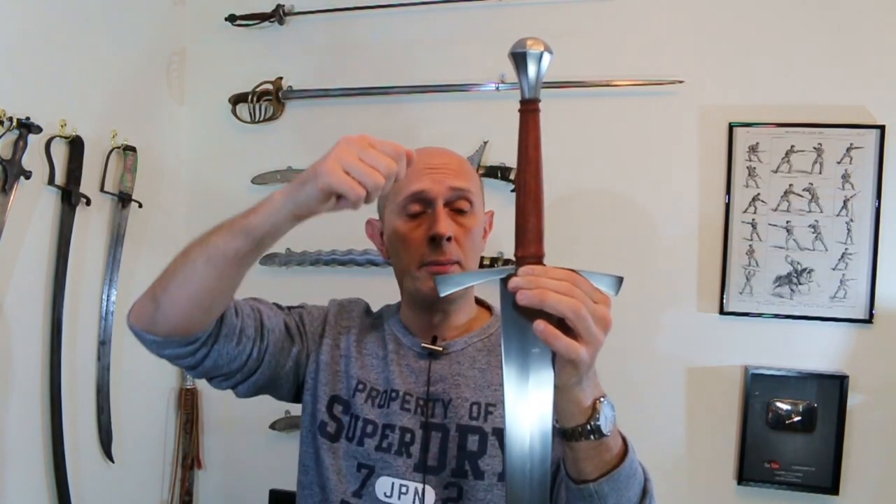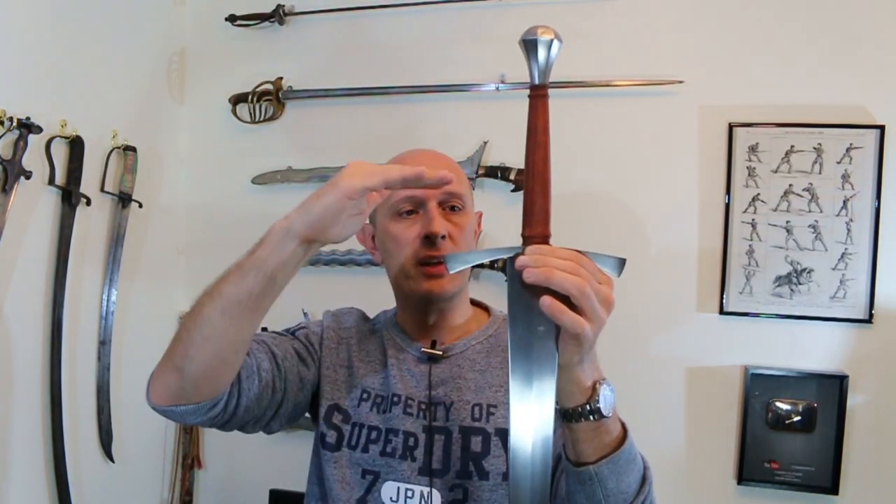But what a lot of people don't necessarily realise is they think: you put the guard on, then you put the grip on, then you put the pommel on, then you peen it all together. Well, it's often not that simple. The key fact I'm finally getting around to — that I think probably not a lot of people know — is that guards are often hammered onto the tangs. When you've got a tang, a stalk sticking up, you slide the guard on, and the hole in the guard should be ever so slightly too small to go all the way down and seat onto the blade shoulder. And then having slid it down, you basically hammer it and essentially forge the thing down onto the shoulder that the guard sits against.